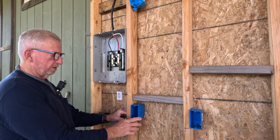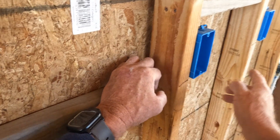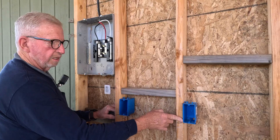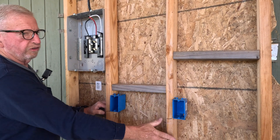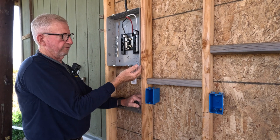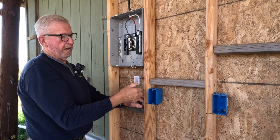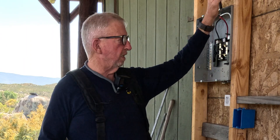These are the boxes and we nail them up against the wall so that when the drywall goes up, the boxes are flush with the finished drywall. For the panel, you also have to make sure it sticks out a half inch if you're using half-inch or five-eighths drywall. Today I'm going to wire up one switch and one light and install a circuit breaker for the lighting circuit.